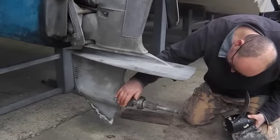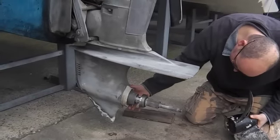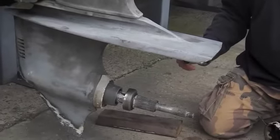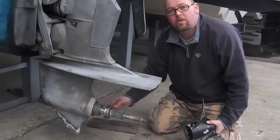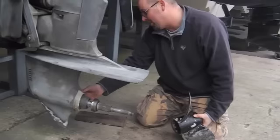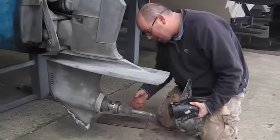While we're down here I'll have a little look at this — this is the anode. Is that what they call cathodic protection? That's right. It dissolves rather than your stern drive, so all the electrolysis attacks that rather than your boat. Absolutely — buy a new one and stick a new one on every year or two.